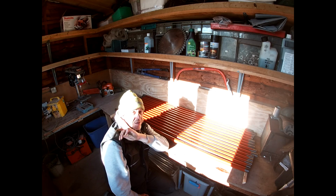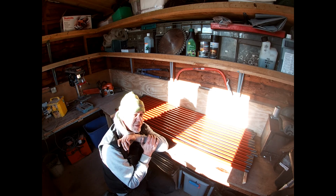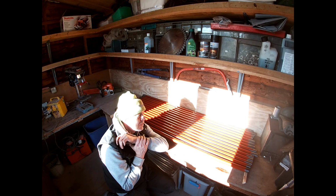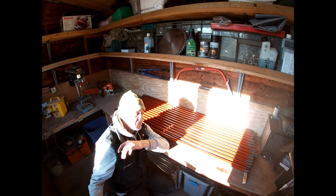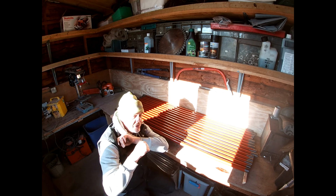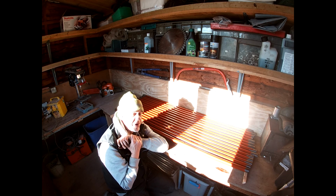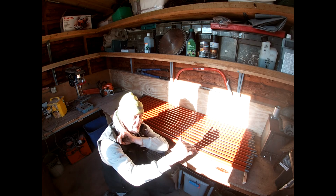So that is the first step in getting this polytunnel sorted out, and by doing this system with these really strong foundation tubes, that will add a lot of stability to the cheap frame that I've bought. It won't improve the strength of the actual frame itself, but it will stop the whole thing from being blown away, because it will be firmly anchored to the ground. So in the next video we will be looking at getting the base frame attached to these tubes, getting the holes dug, getting it all laid out, getting the base frame all the way around, set, level and concreted in. Then we can get the frame up. Now we'll probably put the frame up to mark out where we need to dig the holes, but the first step is getting the whole frame and the base frame set in place.